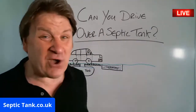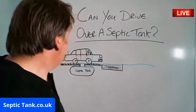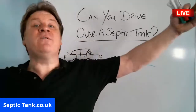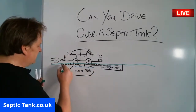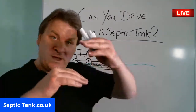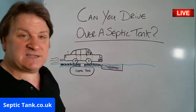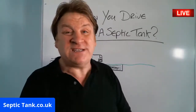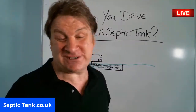Can you drive over a septic tank? No — even if you concrete them in, you can't, because it'll just crush the neck and the lid. But as I said, lots of people put concrete pads over the top. You've got your septic tank, then soil between the tank and the concrete pad, and then a thick concrete pad on top to displace the weight. And you can use septic tank soak away crates for the soak away — they naturally have a 20-ton bearing load, so the car or tractor won't crush it.